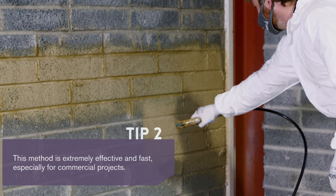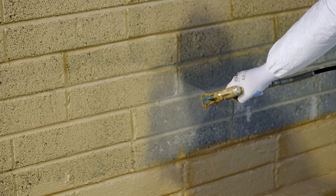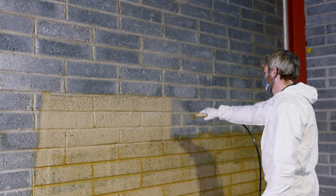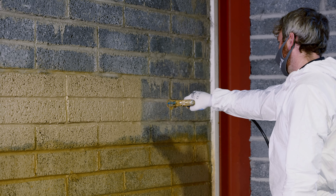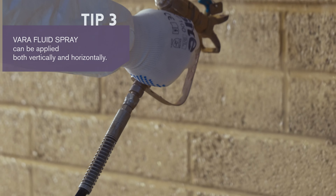For this demonstration we'll utilize the Tri-Tech equipment. Similar to the brush component, Varifluid Spray is a ready-to-use membrane. The most common method to install it is with an airless spray device; thanks to the exceptionally high power, a sufficient layer thickness can be quickly achieved. We continue to apply the sprayable membrane in two layers for optimum thickness.